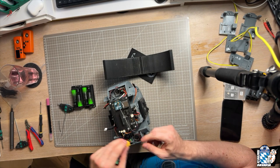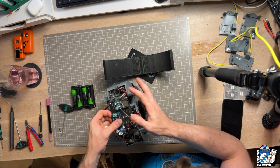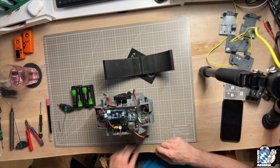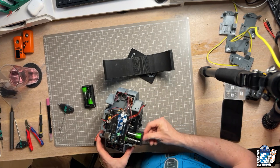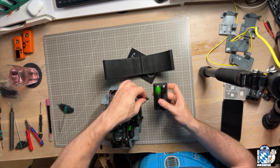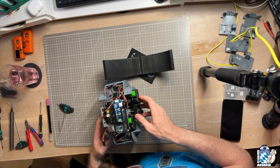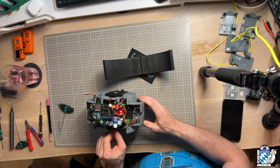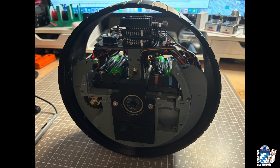In the last step, we add the stack of MKR WiFi 1010 controller and Dynamixel shield. The power cable to the Dynamixel shield plugs into the mainboard, and it has a BEC in the middle that transforms the 15 volts from the battery into stable 12 volts to the neck servo. That BEC fits nicely under the controller assembly and we can plug the cable from the neck servo into the Dynamixel shield. Finally, we connect and push in the battery boxes and give the whole thing a test as we turn it on. This is how it should look from the side, with the main tire added and all cabling out of the way. This concludes part 1 of our tutorial on DOV2 EVO.